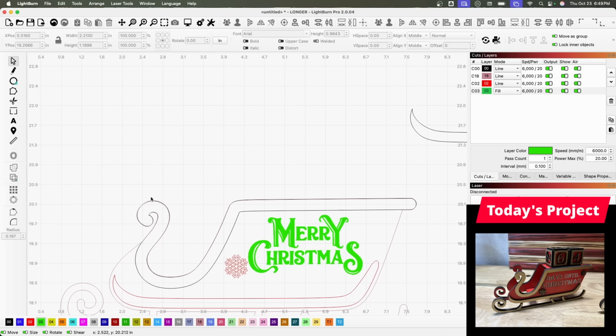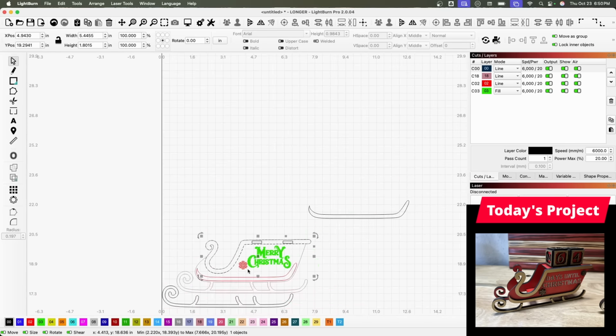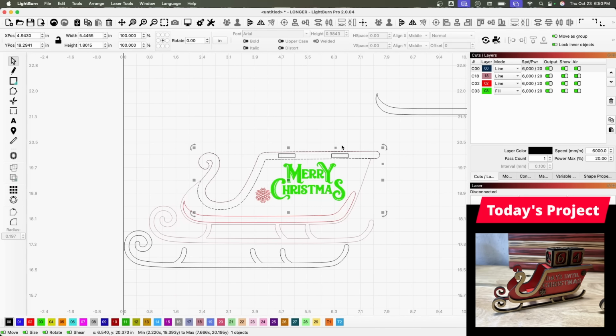So now we need our tab. Done this a few times with our pumpkin boxes and our Halloween coffins and everything else. So we do 1.125. We can do 0.5 for half an inch. Let's see that. Okay, and we want that to be right there. Control D to duplicate. We want this to be centered because this shelf is going to be aligned. Now I'm putting this right here because it's going to be covered, because I don't really want it to be shown, but we can't just have a support at the top. We're also going to need one at the bottom.